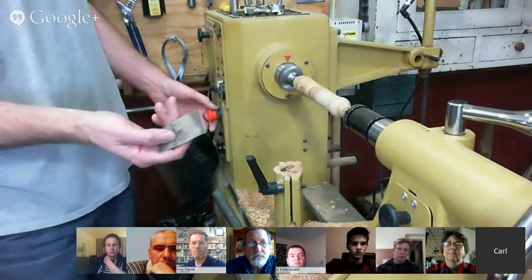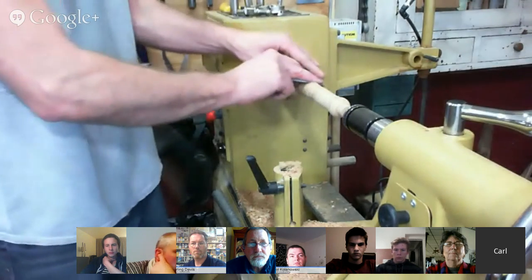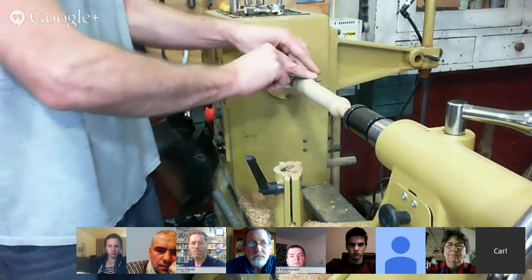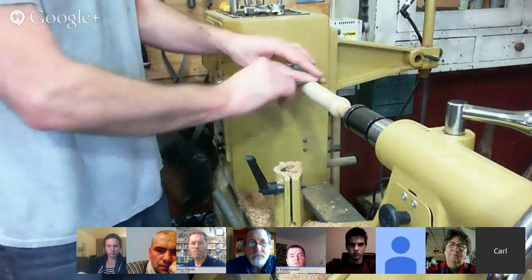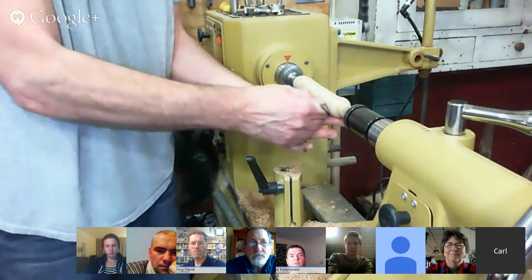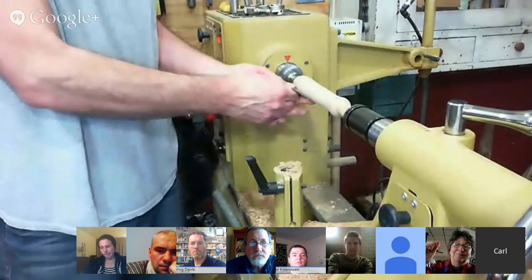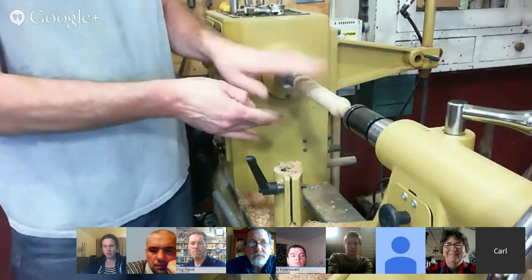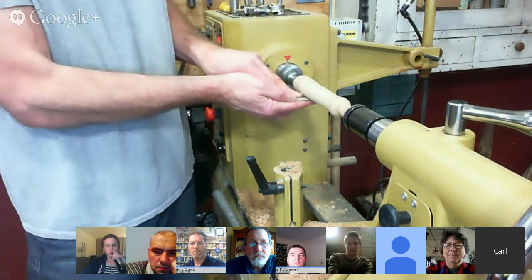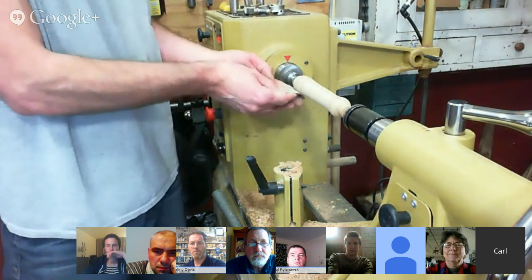All right, I'll sand up a little bit dry, and then I'll show you with the oil on it. Run this over here real quick. Get it cleaned up. And the other thing is try and keep even pressure on it. Don't come in with your first grit and just grind on it, and then the next grit, you know, real light pressure or something. Just try and keep even pressure through all the grits. That way you're not scratching it more.